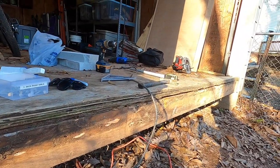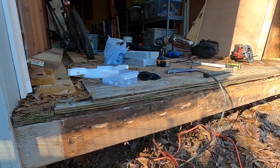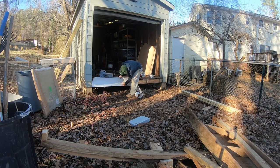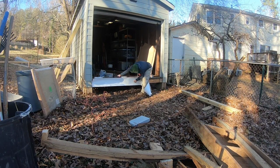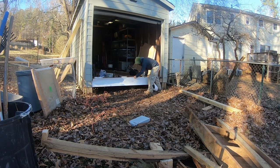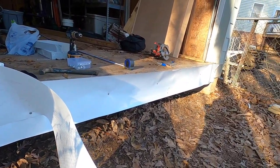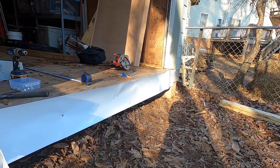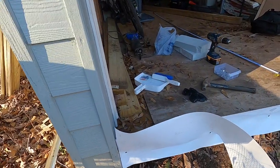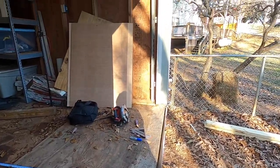You can see here that the ramp before wasn't flashed, so you had water getting in between the ramp and the joist. I knew that had to be addressed. There was also a design problem — the overhang didn't protect it very well. So I actually added another piece so I could wrap it over the top and protect the floor from where that little lip is exposed.